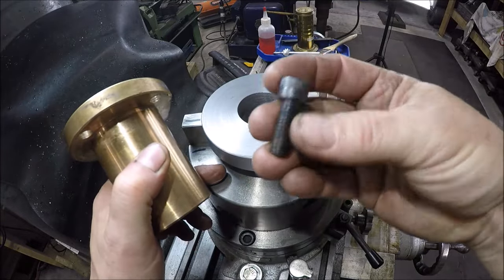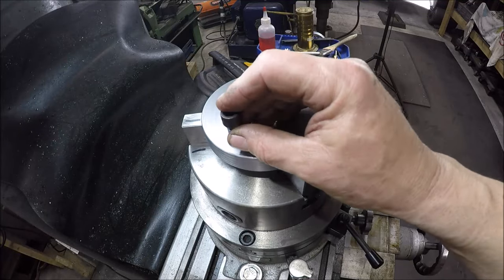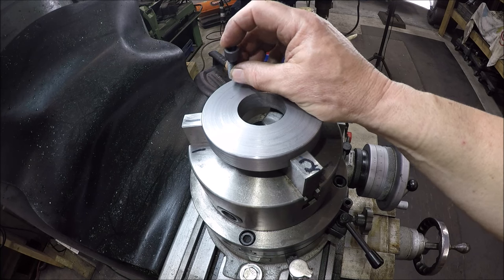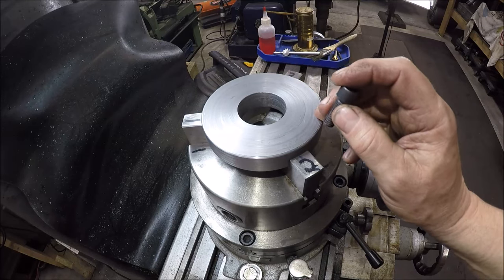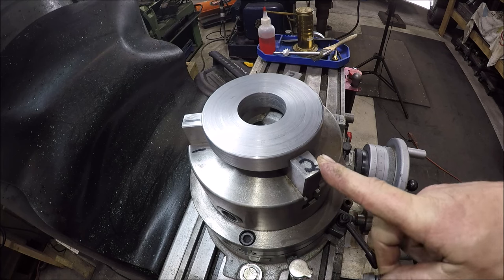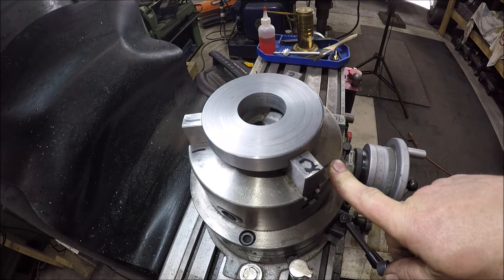And we'll countersink, since I'm going to use some cap screws, so that will hold the adapter into the original holes. And then we move out, and then of course space off 90 degrees, and then we can do the one that's going in there, and that's a 3.5 inch bolt hole pattern. So I mean, that's a nominal size. So I'm gonna buzz these out. I'll probably put you on, you know, 4x speed or something. So this is just, you know, easy drilling, but figured some guys might want to watch it.